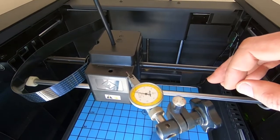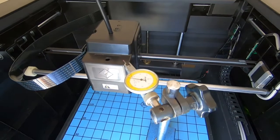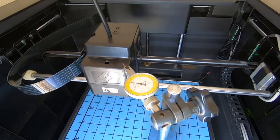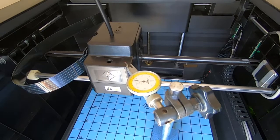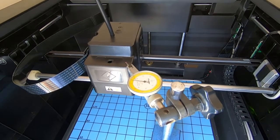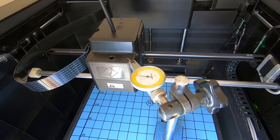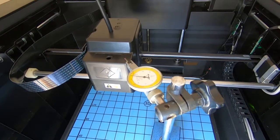In general, what you have to do is run several prints, wait for the machine to try and stabilize, and then hope it doesn't change temperature too much while you're running the print. For very small prints, generally you can get it set up by starting the prints a few times and then just adjusting the screws on the platform until you get the print to stick and to give you a good result. But that leads us on to the second problem.